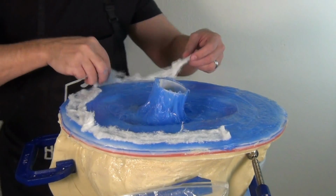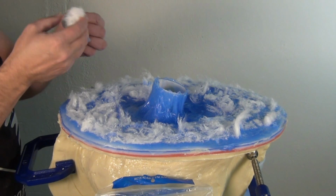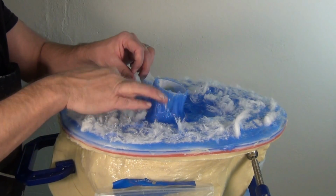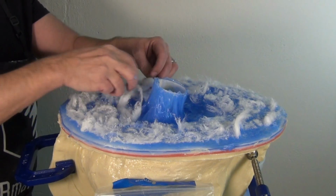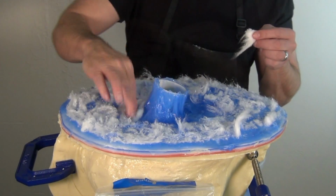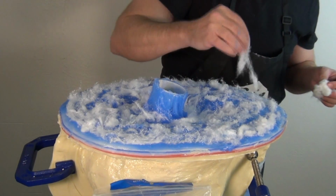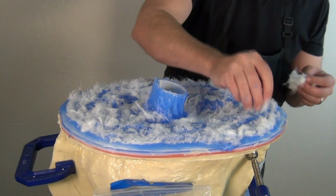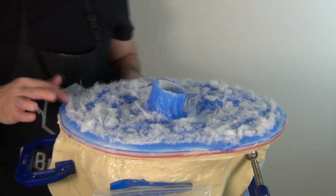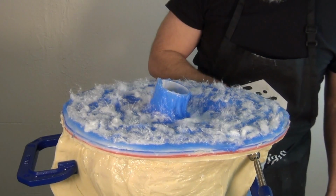Now to do that, you might have seen this in some previous videos where I use some cotton fiber. You could also use cheesecloth in this, but the main thing you're doing here is creating a fiber linkage between the silicone and the rigid support shell. So I'm just taking some cotton balls and unrolling those and pressing that into that wet silicone. And then once the silicone sets, I go back and pull up that extra cotton fiber. And what that does is I wind up with little fibers stuck in the silicone, sticking up out like little hairs that then will bond to that final resin shell.